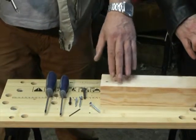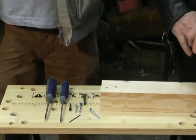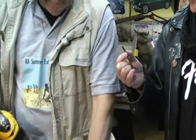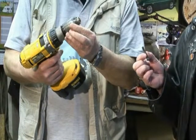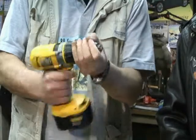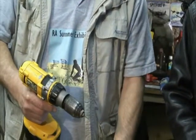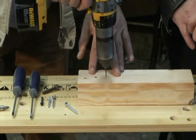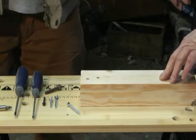Now, most people, when you're going to do delicate work, would have countersunk the hole first. So, in order to do that, this has to be the countersinker. That is exactly it. But first of all, we'll drill the small hole. Some of the countersinks you can get nowadays already have a drill bit and a countersink all built into one. Really? I've got them for the basic ease of demonstration. I won't use them.